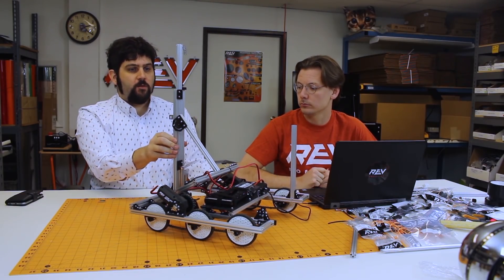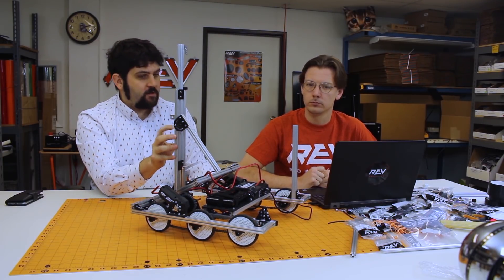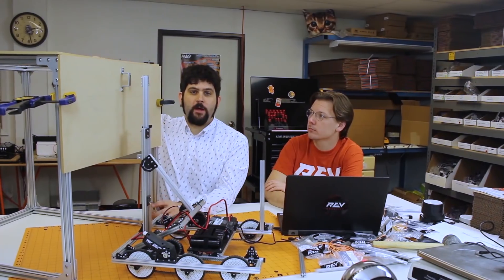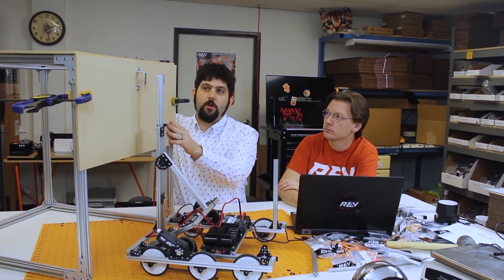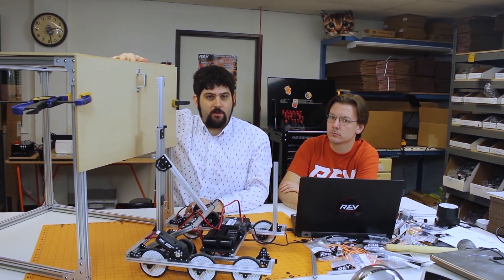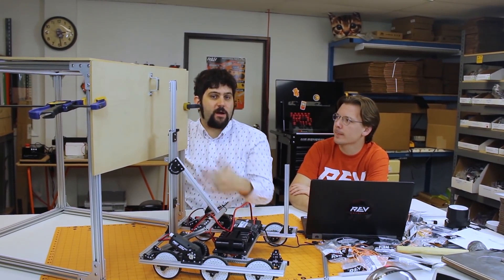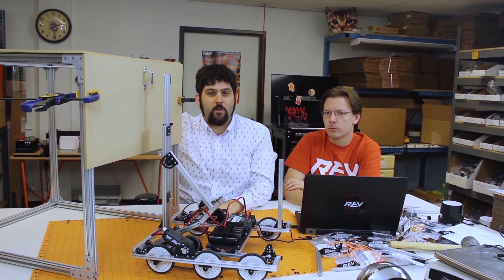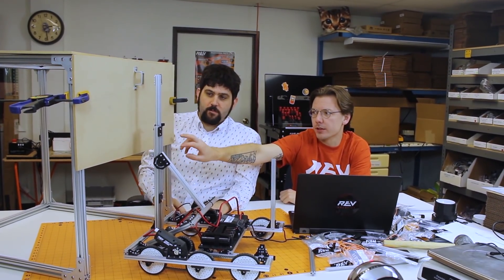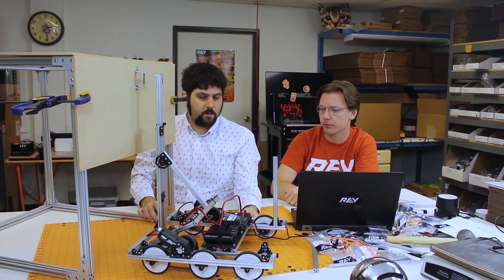One of the things you'll need to do is, because you are lifting your whole robot — just like any year that you have to lift — you have to make sure that whatever your lifting mechanism is, it's as rigidly mounted to your chassis as you possibly can. We don't have a real lander, so we built one out of one-inch extrusion and just a piece of wood. We were able to get one of the actual real brackets. If you don't have a full lander and you want to do this, you can actually just get these little brackets from Andy Mark for $4, build a wood structure, and make sure the brackets are in the right place. One of the big things is making sure the lander plate is at the right length, as close to spec as you can get it for your testing.